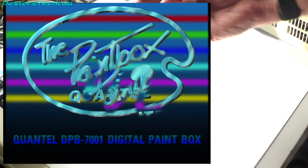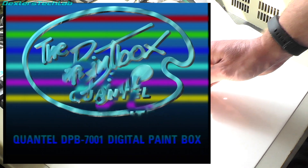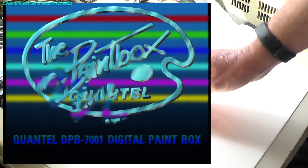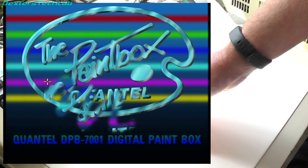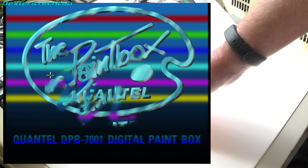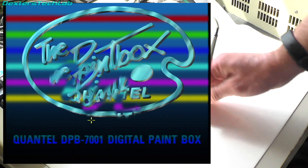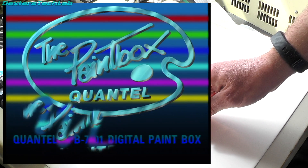So what the CPU card is doing is taking the input from the pen, converting that into a set of coordinates on screen, and placing those into the combiner card. What the combiner card is doing is displaying the whole picture in the background, and then when it gets to the point where it wants to display the cutout, it goes through every single pixel one by one, combining the background — which is in one of the stores, the main picture in store two — with the cutouts in store one. Combining them bearing in mind the actual stencil around the cutout, because you can see how it all blends in; it's not just a hard edge. It's combining the luminance and chrominance, and at the moment we only have one key on — the key that is on the cutout.